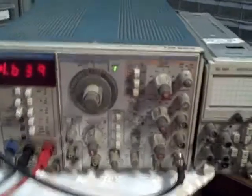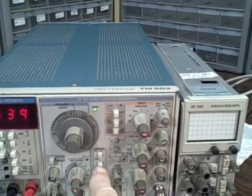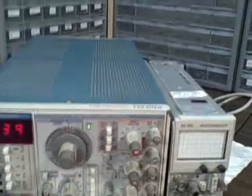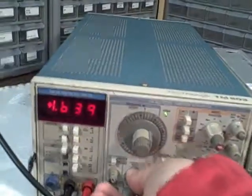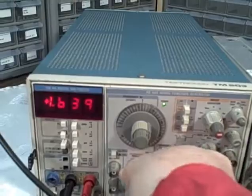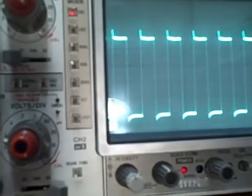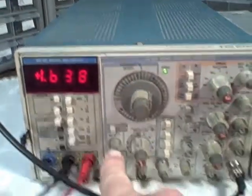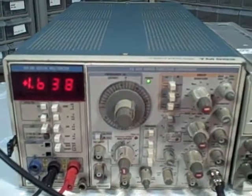So many aspects of the unit are functioning fine. There are trigger modes — right now we are in free run, there is also a trigger run and a gate mode. You are going to have to go to the manual to find out more about it. I can change the frequency by step, and there is a frequency range control. And then there is a voltage controlled input — you can feed a voltage in and provide a swept frequency.